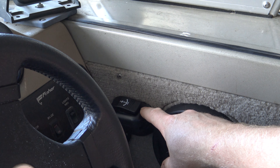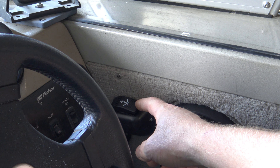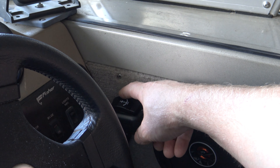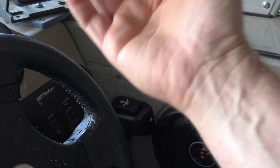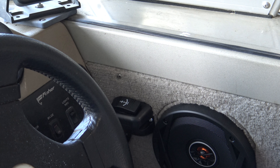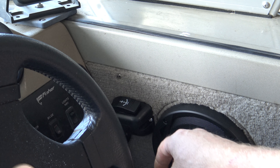This switch is the same as up front — towards the back is the down, and you've got the up. One thing you need to know: when you're hitting the up button, whether here or on the unit, and your anchor comes up into the stowed position, it's going to keep cranking in — there's no auto-shutoff. That's one of the cons: the anchor comes up, goes into the stowed position, and it keeps pulling it in. There should be a stop somewhere, but if you hold down the up button, it's just going to keep on cranking. So you have to watch it, and as soon as it pops into the stowed position, just let off the button.